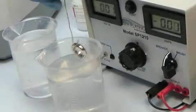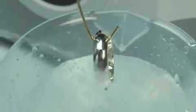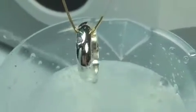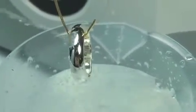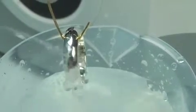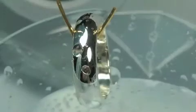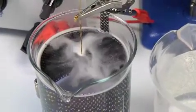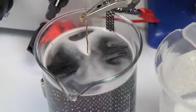At this point you might think that the surface of your work looks clean. However, if you try running water over it like this, you'll see how the water draws away from the surface into rivulets and droplets, forming clear water breaks. We need to get rid of these water breaks for top quality plating, and so the next stage is a power clean with Spa Plating's cleaner. As soon as the work goes in and the correct amp level is set, you can see the cleaner go to work.